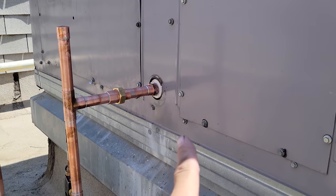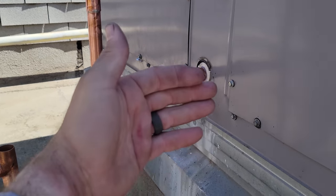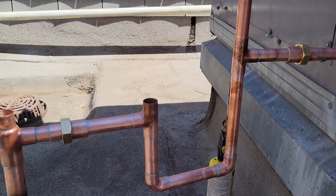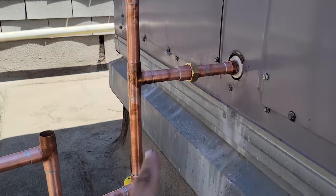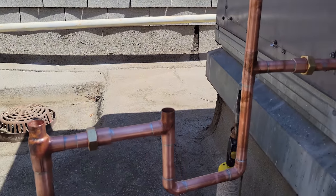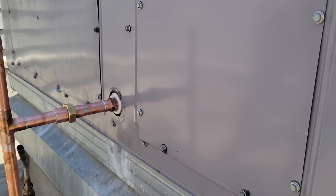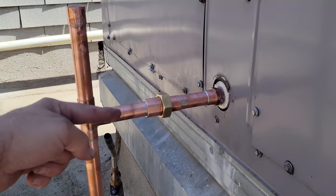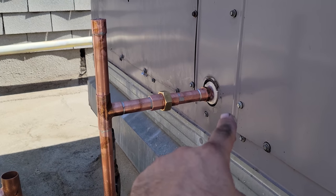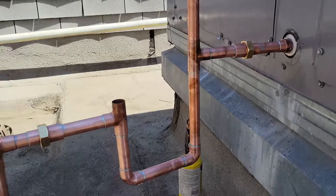Because this return air and the drain pan is on the return air side, there's a negative pressure on there — it's pulling on that pipe. That's why we have to have water in here, because it prevents air from sucking in through there. If we didn't have this trap, it would actually suck in air through the drain and it wouldn't let the water drain out and would overflow inside. You could literally take this off the unit while it's running and you'll just see the water barely drip while it's overflowing inside. So we've got a nice new trap.